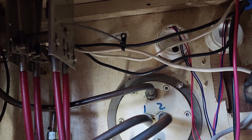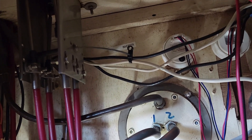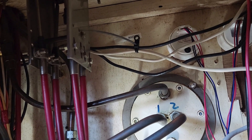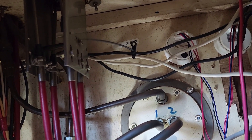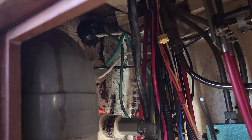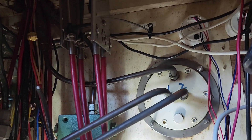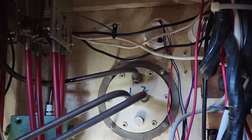So I'm thinking, the ELCI would never work — not even close. I had to read up on troubleshooting for shore power AC leakage. It can cause lots of problems in many different ways, one being a safety factor. However, it did appear that the vast majority of the leakage was going out the ground — the green wire — back to shore power, so I guess that's better than into the water.